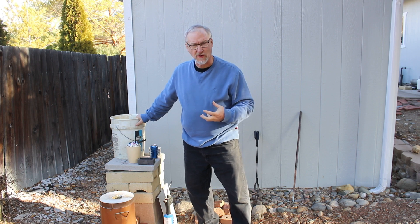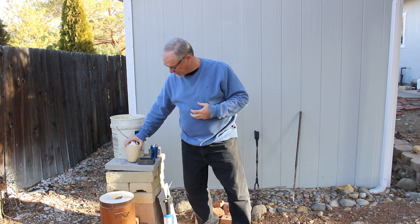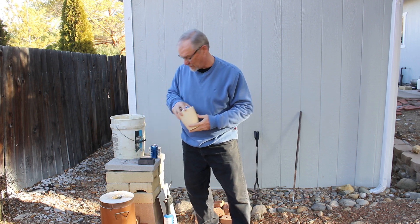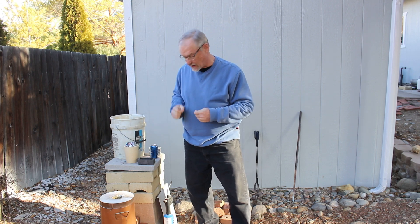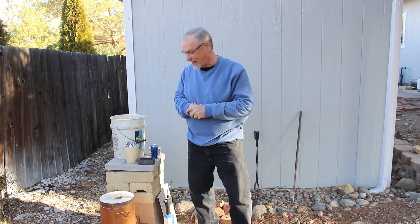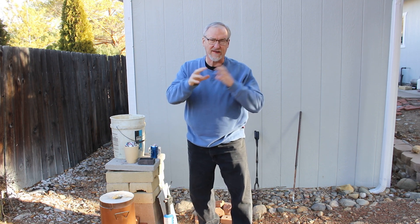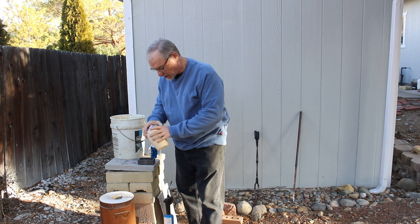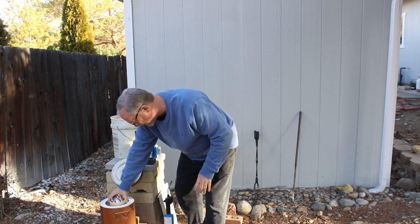I want to know how much usable aluminum is in an aluminum can. I've weighed out 100 cans and they weigh about 1.4 kilograms, 1400-plus grams. We're going to melt it all down, scrape the dross off the surface, pour some bars, and figure out the percentage. Let's get started — I'll put the crucible in the furnace, got it all prepped up and ready to go.